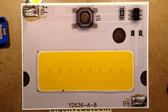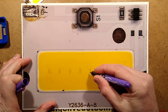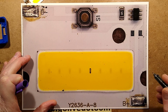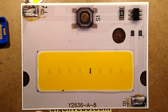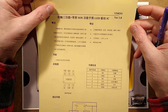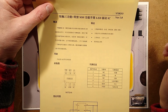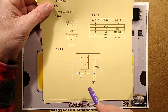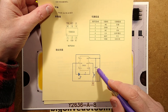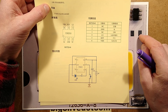Here's the module — it's got eight what I'm guessing are flip-chip LEDs, mounted lengthways; you can actually see that shape in there. They're controlled from a chip called the YN890. I searched for the YN890 and didn't find a datasheet, but I found a pin-for-pin compatible chip, the YX8253, by YX Electronics — a fairly big company. It likely matches their product. The push button matches the pin-out. There's a 10-microfarad capacitor shown for stability in the datasheet.